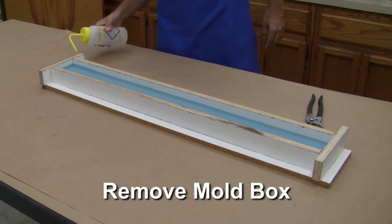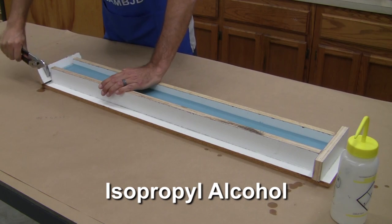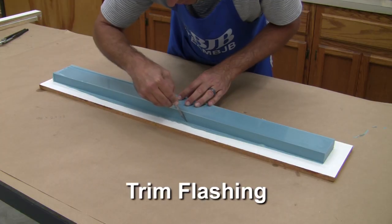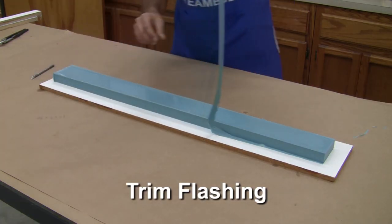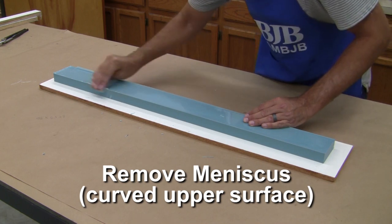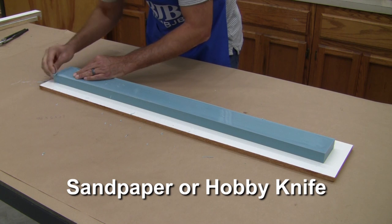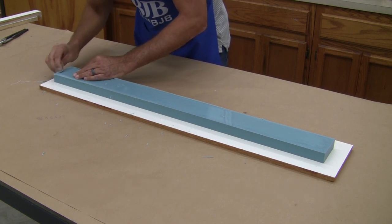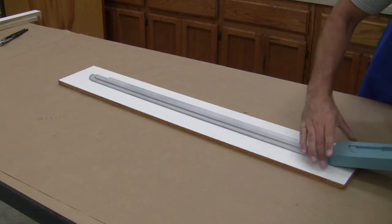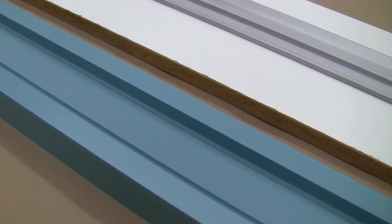We make sure the long mold is level and adjust as needed before the silicone cures. Once the silicone is cured, we begin the process of removing the mold walls. Isopropyl alcohol loosens the hot glue's grip and they pull off fairly easily. Any flashing from the silicone can be removed with a sharp hobby knife. A slight meniscus forms along the top edges, so it needs to be removed in order for the mold to lay flat — 100 grit sandpaper can knock it down, or you can slice it away with the hobby knife. We can begin slowly demolding the silicone from the pattern, ensuring nothing is locking it from underneath. Our silicone mold came out beautifully and captured the matte finish of our pattern in perfect detail.